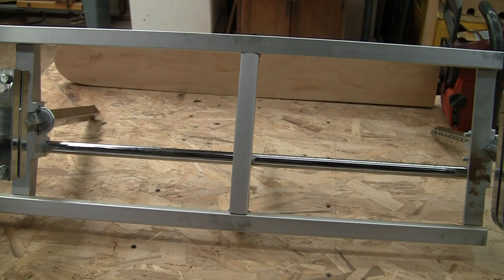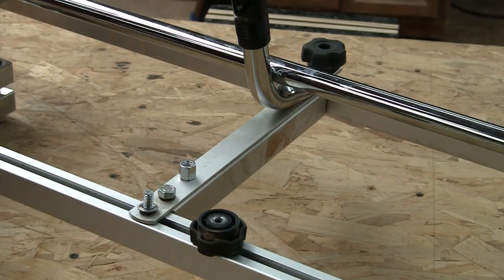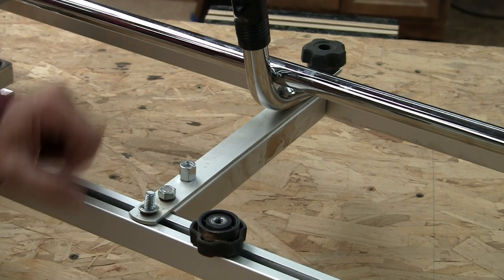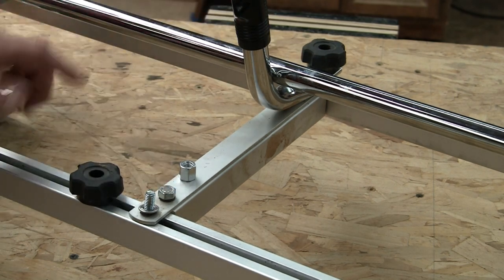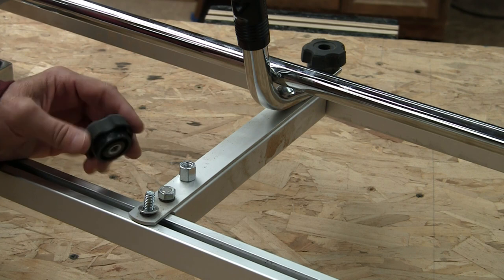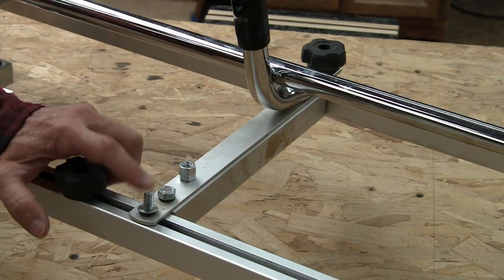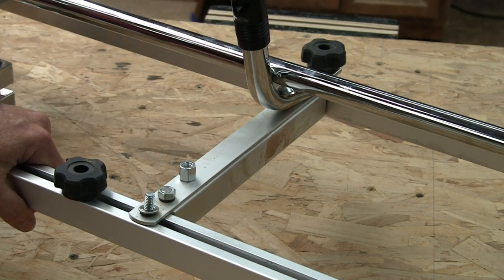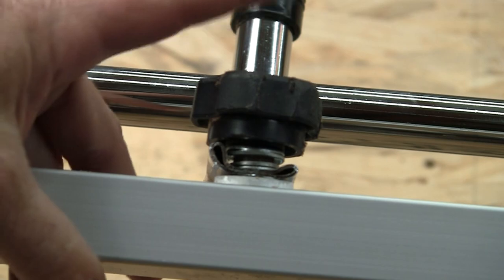Next I shortened the stabilizer bar by about 1/16th and added a slight radius to prevent binding. I used my disk sander but a file will work too. I replaced all four nuts on the stabilizer bar — two were replaced with knobs to allow for quick tool-free access and adjustment of the bar, and the inner two were replaced with regular M8 nuts. Then the bolts were cut off flush to prevent interference with the knob. Metric knobs are nearly impossible to find here in the U.S., so I used 5/16th knobs and replaced the metric carriage bolts with 5/16th by 1 inch carriage bolts. All four connections got lock washers as well. Due to the funky shape, I added a bunch of flat washers to provide a nice flat clamping surface for the knob.